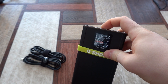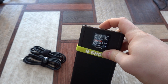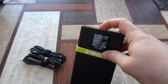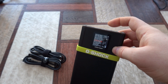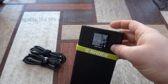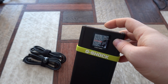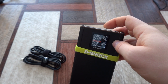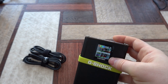One interesting thing here is a re-rate feature. It actually re-rates the capacity of the battery, so if you replace the internal battery inside this power bank you can set the new values. To do that you select this menu and then calibrate all the necessary parameters. Okay, let's go back and test it with some loads.